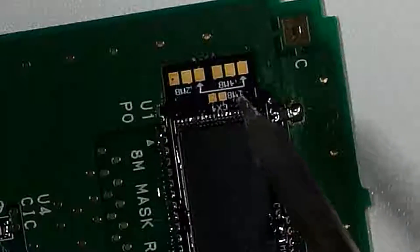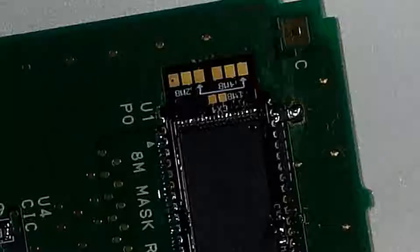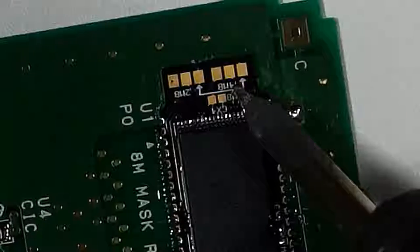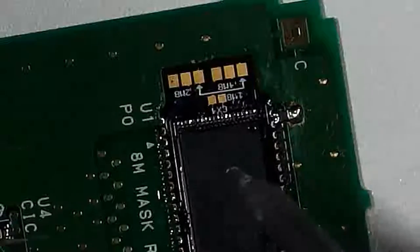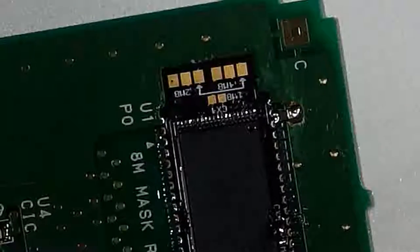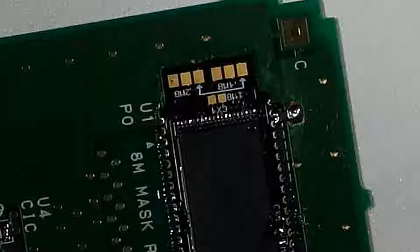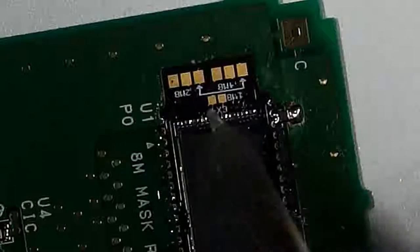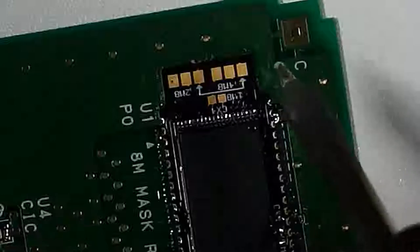So now down on this CX4 pad here, that's going to be a little bit different. So we need to set that low. And the issue is that this side here of the pad is correct. That's actually going to the pin that we need to set high or low. We need to set low, but for some reason I made a mistake when making the modification to this board, and I configured this pad here to go high.